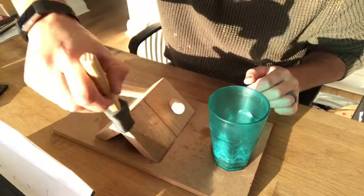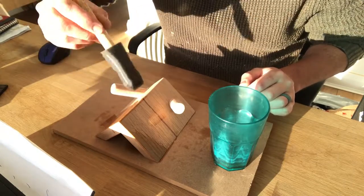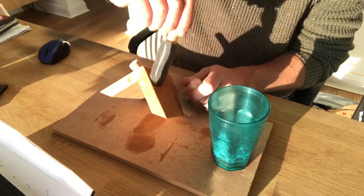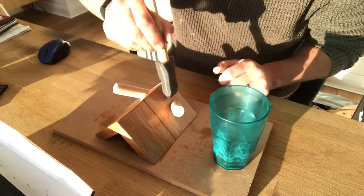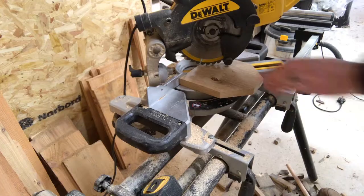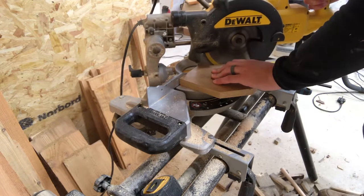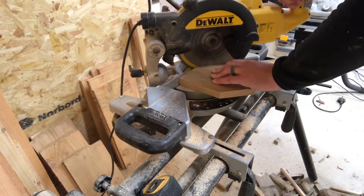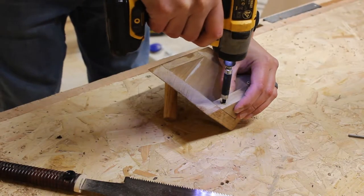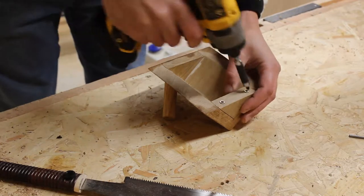I then finished the coat rack with a couple of coats of Danish oil, slightly sanding between coats. With the second and third small triangles I cut earlier at the mitre saw, I wanted to make a DIY mounting bracket as I didn't have anything else spare available. One small triangle goes to the top of the coat rack — I glue it in and also drive in some wood screws to reinforce this joint.